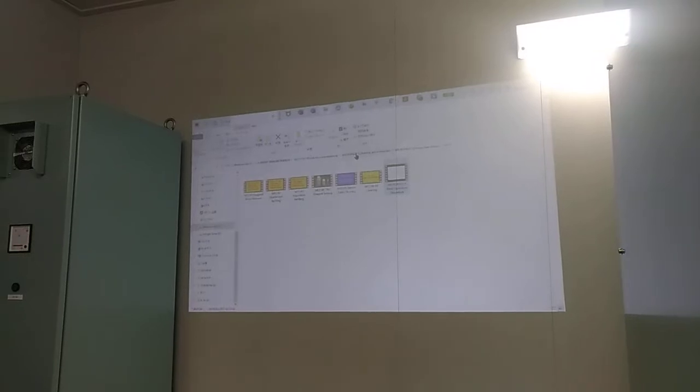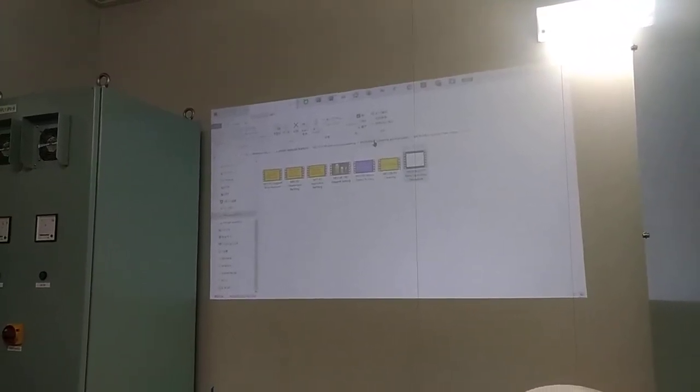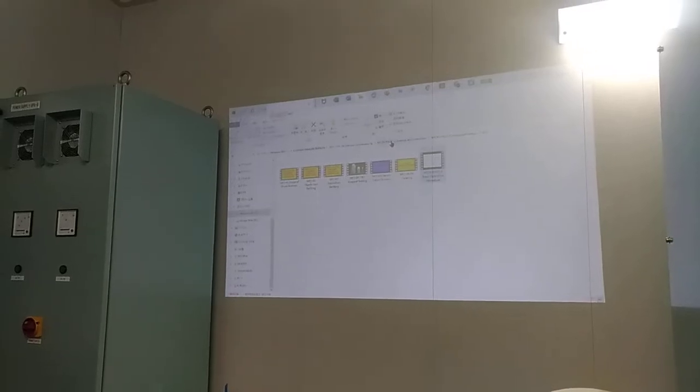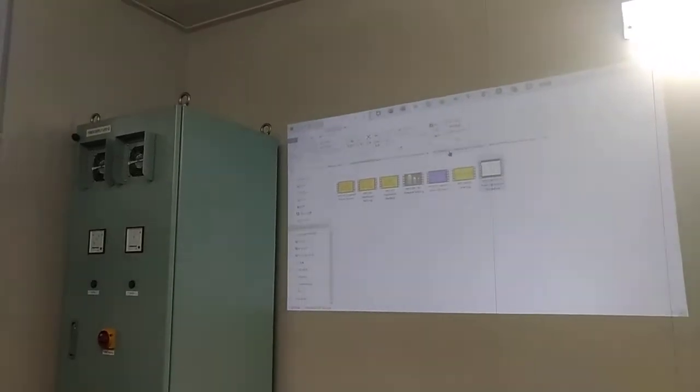This is the TRO sensor unit. So we can see the TRO unit. You will be reading 6, or 7, 8. Normally it's 6 to 8 ppm. This is the standard. But if more than, what's the problem for that? Okay, wait.